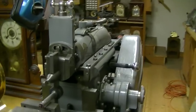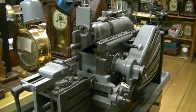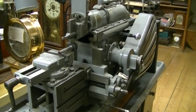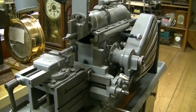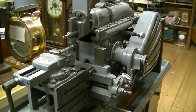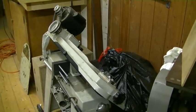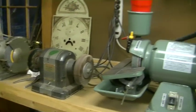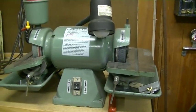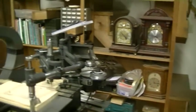And lastly — this, if I can get back far enough — this is an Atlas 7B shaper, a tool you don't see very much because anybody that has one of these doesn't need it, because they can do the same work on a vertical mill — almost the same. It's an unusual tool but you do use it occasionally. Horizontal bandsaw, and a whole row of various grinders. This last one here has green wheels on it so I can sharpen carbide, and then I hone it on that Leonard Lap and Grind.